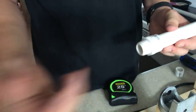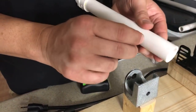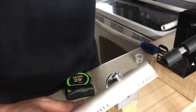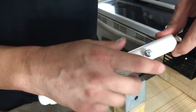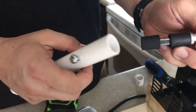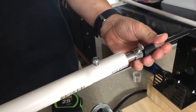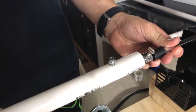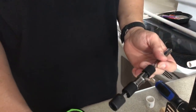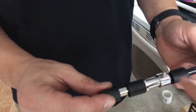The football end sits down in here. I've got a screw that goes through onto the shaft mechanism, and this screw tightens down on this piece. There's a ring indention where the inside of the screw fits so you know it's tight. When the motor is turning this shaft, you don't want the PVC to go out of sync — you want it to turn as one. The only thing on the parts list that changed was we had nerf balls listed.